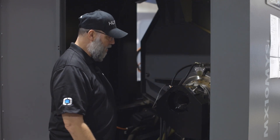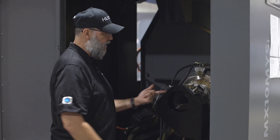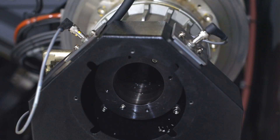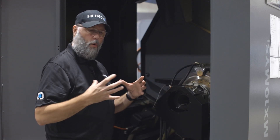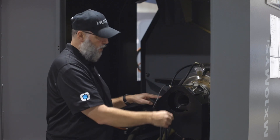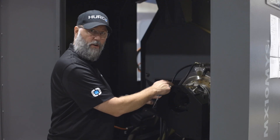When I hit the clamp and unclamp foot pedal, you'll see that we went from an open state or unclamped chuck to a fully clamped state. When I go back, we're in the open state and the unclamp indicator will light up. The idea is that when we're all the way open or all the way closed, one of these switches will be made. There's a ring on the end of the spindle that moves back and forth with the draw bar, and that's what's triggering these two switches.